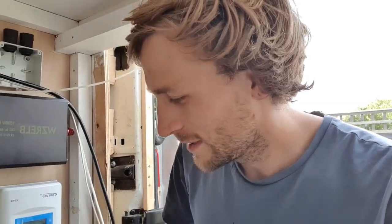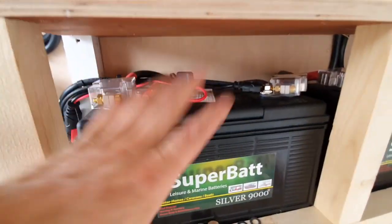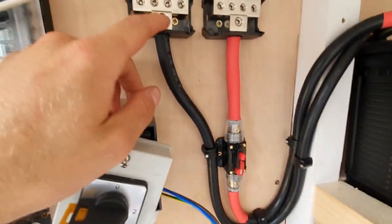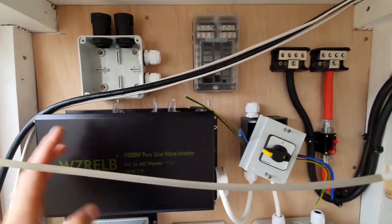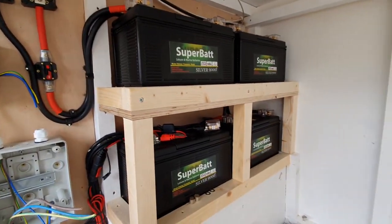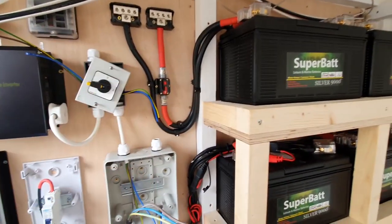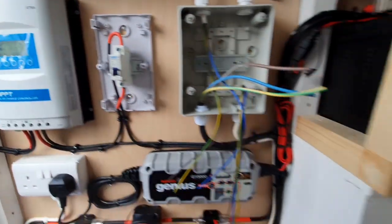The batteries are all connected. The power supply side is all pretty much done. All the positives are linked together with all the terminals nicely greased — that battery to that battery to that battery, over to this battery — and then it links off these terminals down onto my blocks. All my outgoing circuits — fuse board, inverter, whatever else — will all come out of there. Just to prove it: 14 volts DC. Lovely. With all the batteries connected in parallel, I've got 14 volts DC, which means I've got my full 480 amp hours and still 12 volts. 14 volts is maximum charge, which means they're 100% charged.